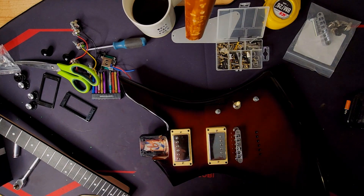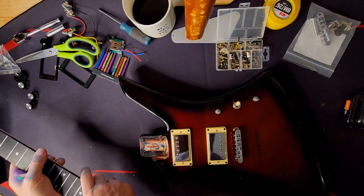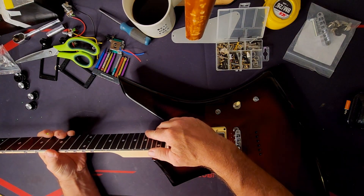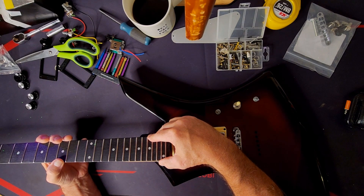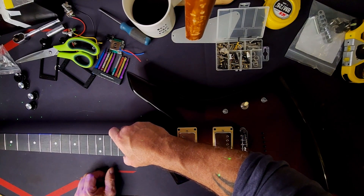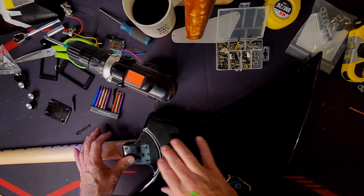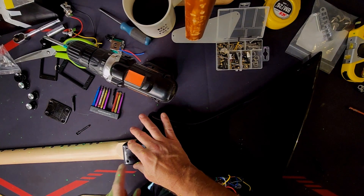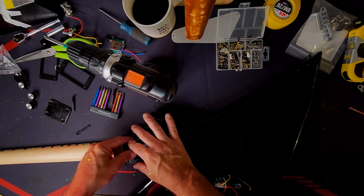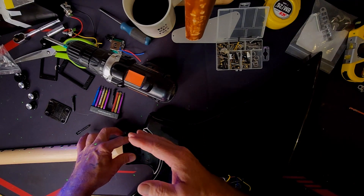Let's check this neck out and see exactly how this neck is going to fit. I've got the screws and the neck plate on here and hopefully we're about lined up where it should be. What I like to do when doing a neck is we give an initial hole drill but give ourselves a little bit of wiggle room. We've got this nice and straight and flush on the side, but I still have room to wiggle the neck back and forth. We know we're flush here and here, so the neck can't move in the neck pocket from left to right — but it can alternate at the end and move back and forth this way.